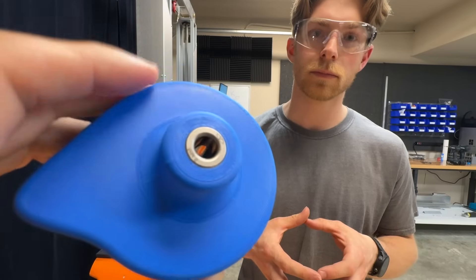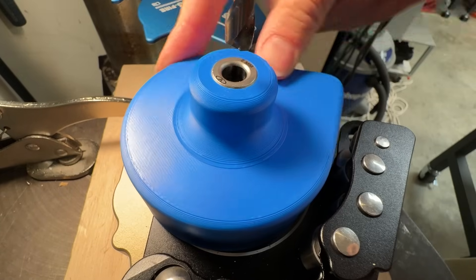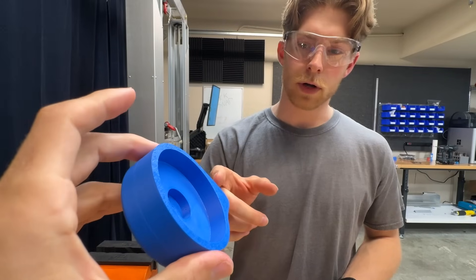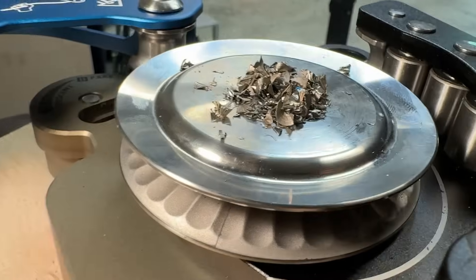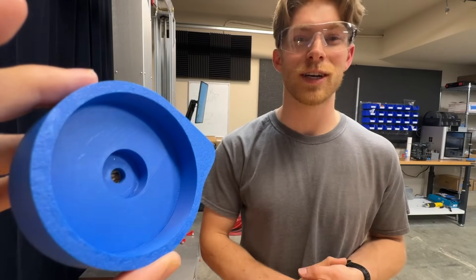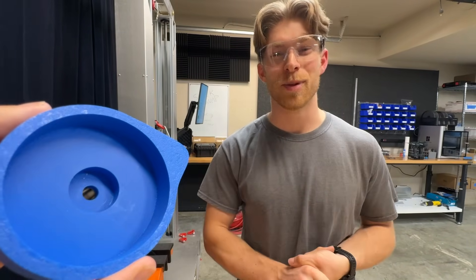You can do this with plastic because you have the metal insert. And why does it look like an eyeball? So that it doesn't spin. That hole is to provide room for the metal chips to have somewhere to go — the first revision of this fixture did not have as large of a hole and the metal just dug itself into the plastic.